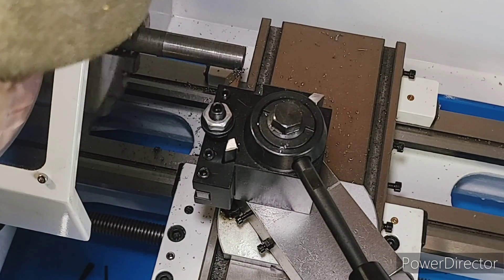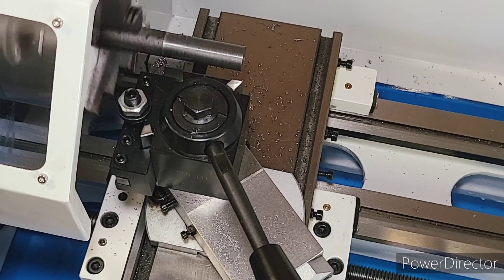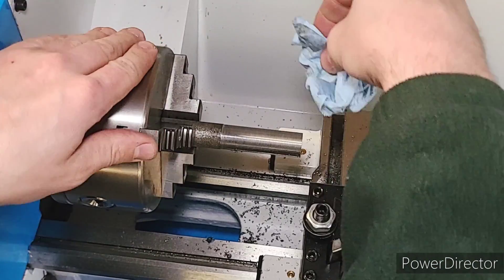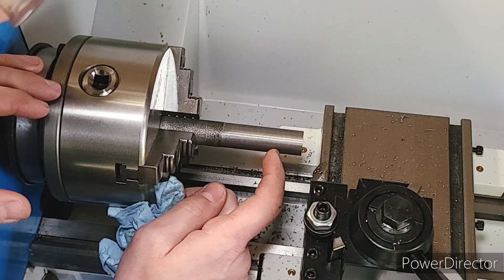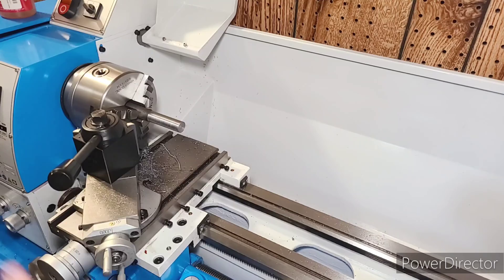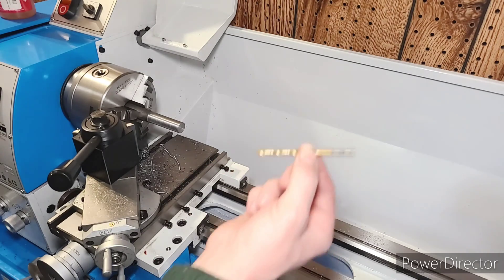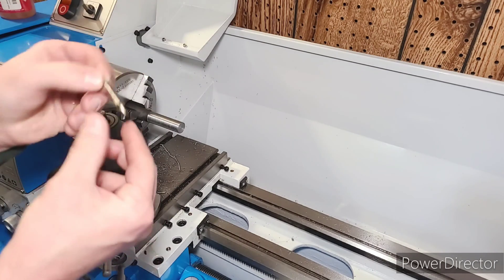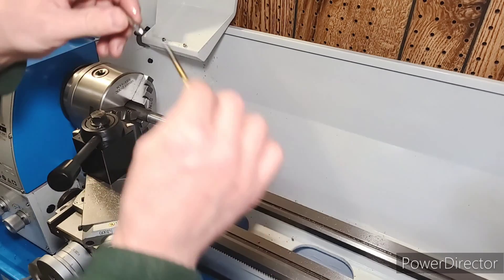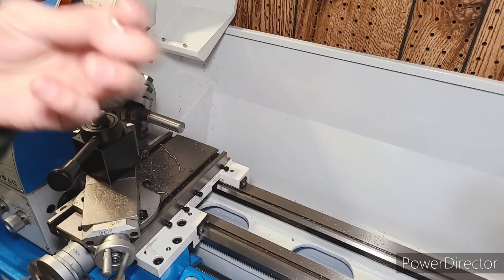Look at that finish — that is definitely better. Not sure if I was going too fast or if it's inconsistent, but still a pretty rough finish. Next up, we're going to drill a small hole in the center of this part. The drill size we're going to go for is 7/32. My drill index is very short on drill bits right now, and it's one of the few that's very nice and new. We're going to try center drilling with this number three center drill. I'm not exactly sure which size is appropriate, but this one is pretty close in shank size, so we're going to go with it.